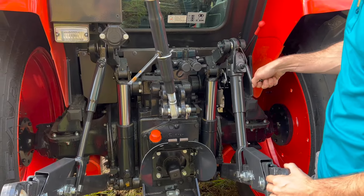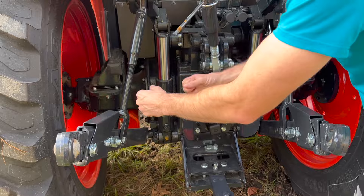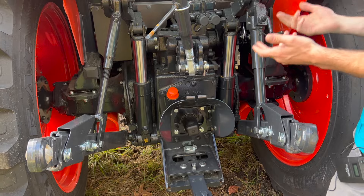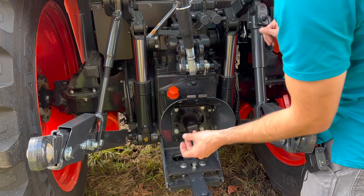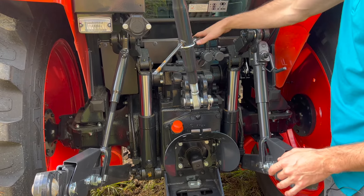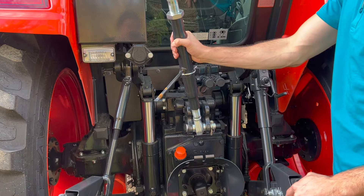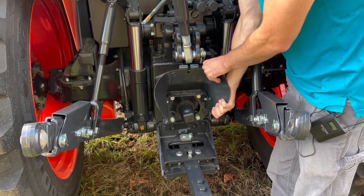One of these is adjustable with a turn handle, which is cool. The other side is adjustable but you do have to pop the pin out and turn it by hand. You'll see that there are external pistons for the three-point hitch, which is very heavy duty. It's nice that they're external — in case you have an issue with lifting, the pistons are outside to be serviced easily. Grease zerks on the top and bottom of those. Single rear remote standard — if you add a second or third, you pop these bolts, undo this, stack them on top, and put the new bolts in. Pretty easy install.